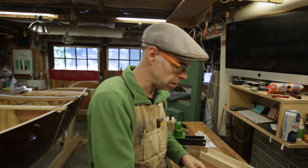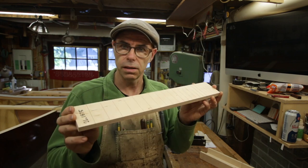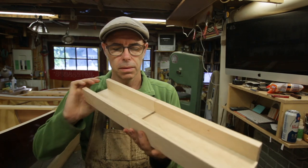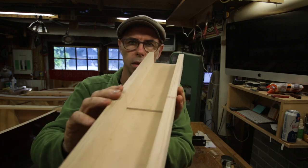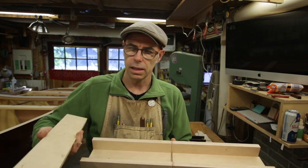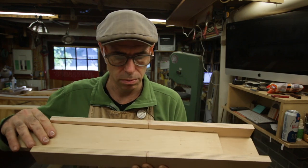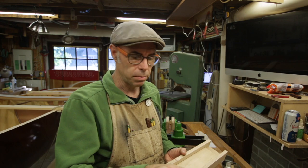Taking that a step further, what I actually did was drop a piece of plywood on there and use this to cut slots in the plywood — and there's my piece of plywood. This is another indexing device. I take a double-sided tape piece of fretboard material and stick it onto the back side. This new miter box has got a little indexing blade — I used an Olfa knife blade in there because it was just about the right thickness, a hair thinner than the actual saw kerf, so the kerf drops in nicely. With my fretboard material stuck to that, it just slides along and easily drops down into the right slot.